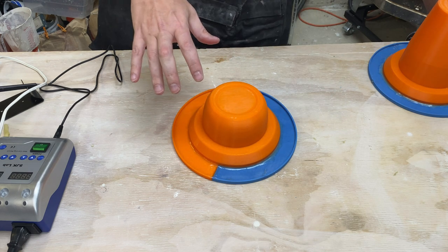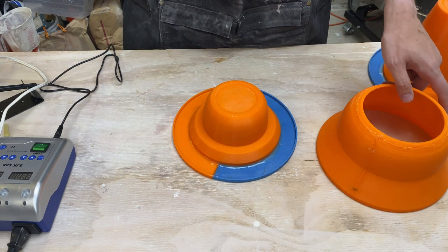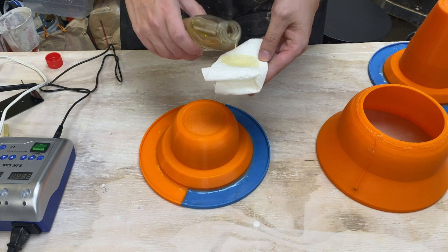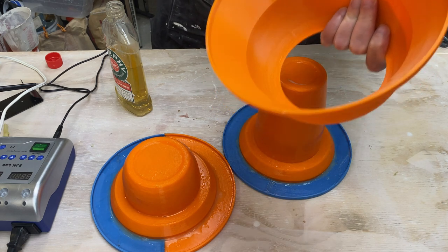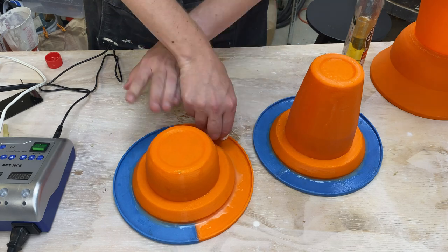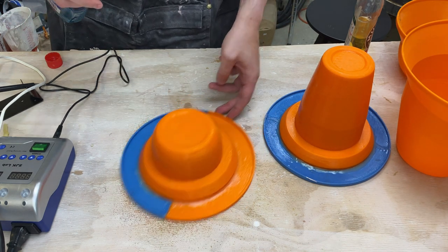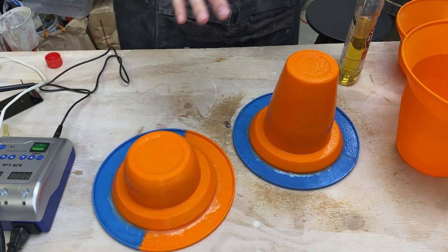Next will be the outer mold. However, we don't want to put that on yet because we need to put some mold release on first. I'll put my mold soap on and cover it liberally so we have a chance to get everything out. Usually this is used as a barrier between layers of plaster, but I figured it probably won't hurt on the 3D printed part as well. I'm also going to do the inside of the outer mold. And the last little bit of protection — I'm going to spray some Windex on this surface. This is a surfactant, so it should help break the bubbles when the plaster touches it.